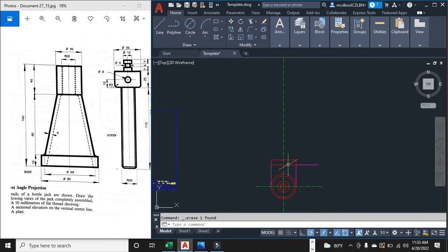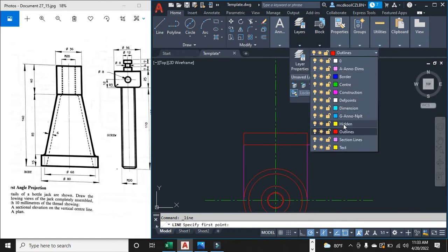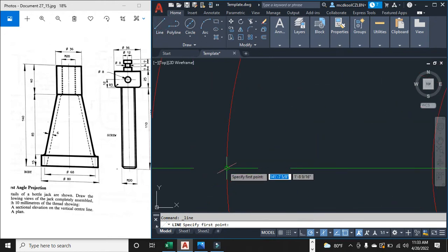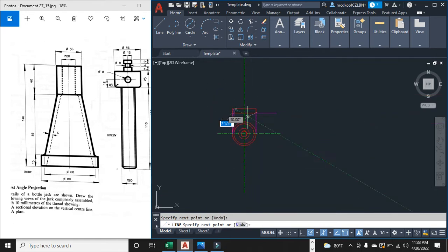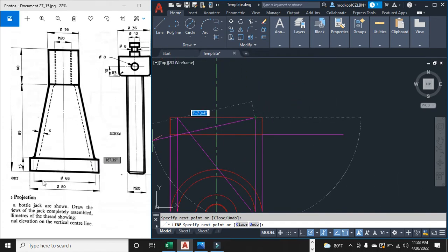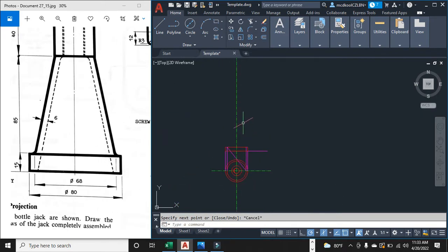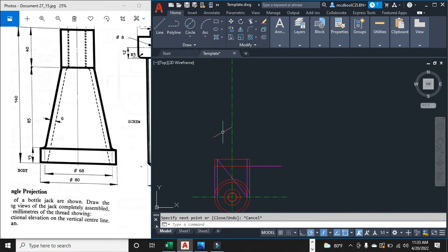You understand this so far? So that's the bottom of it, all right? So this other piece now, it should be a construction line, sorry. This line comes from here, straight up to here. So that is the 68 that's here, you understand that? So now I can't do that slanted line, I need to offset it. I need to offset the 85 and offset the 40.